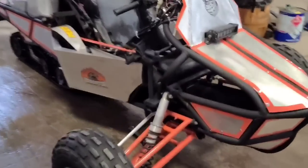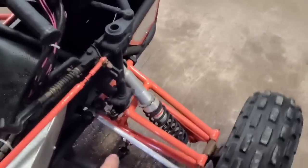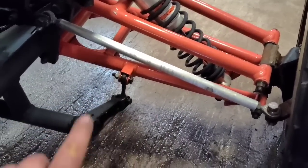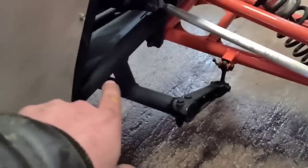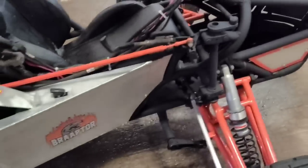So when I got back, I peeled the sway bar out of an old Wildcat, I think it was. It actually worked out perfect lengthwise, because the Yamaha RX-1 control arms already had a spot for the sway bar links there, so everything from the Arctic Cat worked out perfect. I just added some more tubing, welded a couple of braces, and put it across. Problem solved. I haven't really tried it since then, so we might try that out now. Now that it's more stable, I think we can get some more speed out of her.